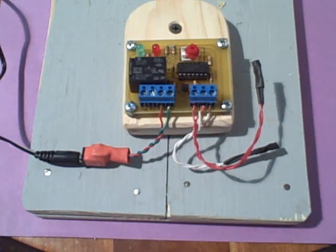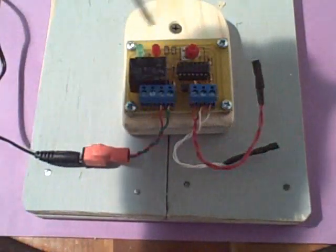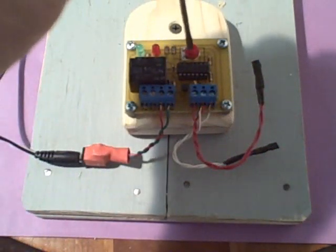Right now, the voltage at the common junction is about 2.5 volts. At that point, the pump comes off. And we can adjust that point right here with the differential pot adjustment.